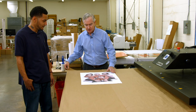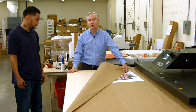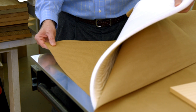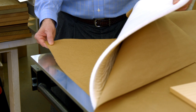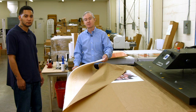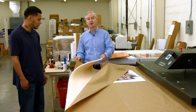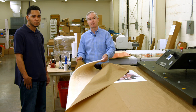Here at the press, underneath you can see a Nomex pad. There is no rubber pad on these presses. Underneath the Nomex pad is a piece of cardboard, and this cardboard collects moisture. The sources of moisture are incredibly important to deal with. During the course of a day, this pad may be drenched with moisture if you press a lot. So you need to be aware of moisture and make sure you're dealing with any moisture problems that crop up.